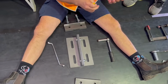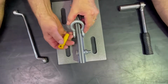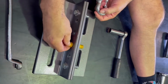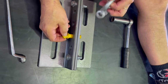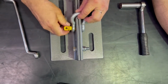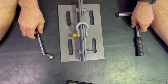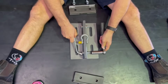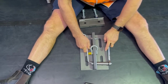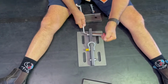The dimensions of the 2-ton shackle have been measured to fit perfectly around the sides of the flanges of the beam clamp, and the pin needs to go through the hole smoothly without binding, so that it can turn easily and function normally as a shackle should function. So if you like, you can start off with this process by having a shackle in place. That way, when you do tighten the bolts that are keeping the beam clamps together, we know that the holes are completely aligned and there shouldn't be a problem once you get up onto the beam that you're installing on.